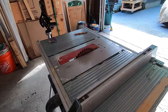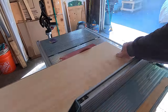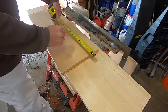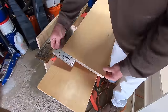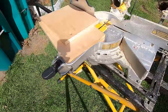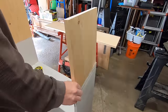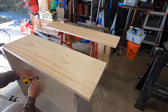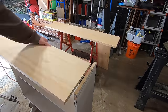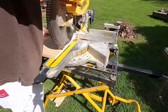I decided to rip the wood boards that I bought down to the right width of the existing boards. I didn't want to have extra seams, so I made it so that the uprights were just on top of the other one. And I put the shelf part in between the boards instead of the sides. The cut edge doesn't show — the end grain of the board does not show on the sides. And then the seam we covered up with the existing molding.